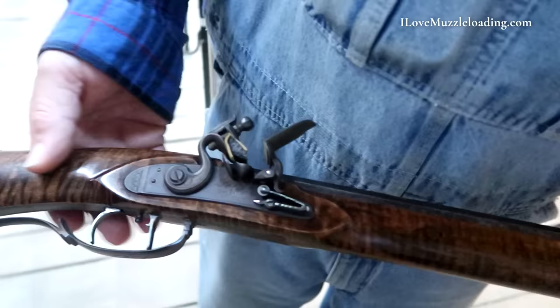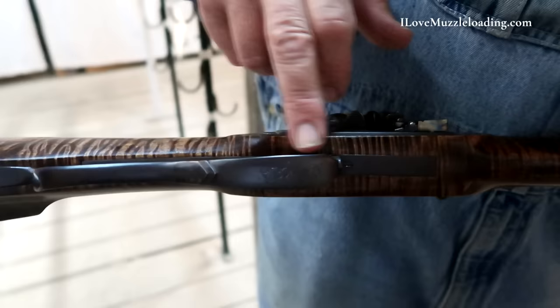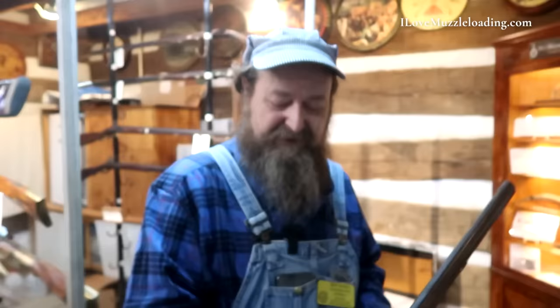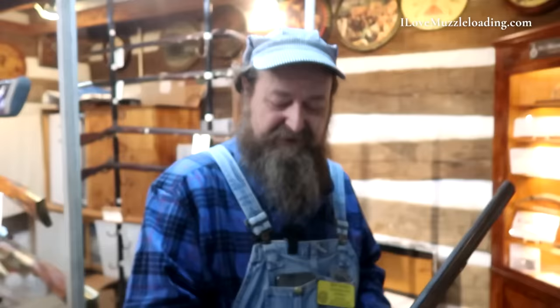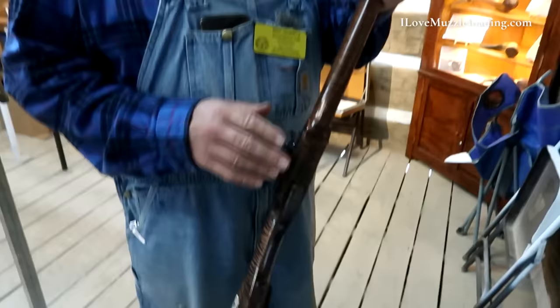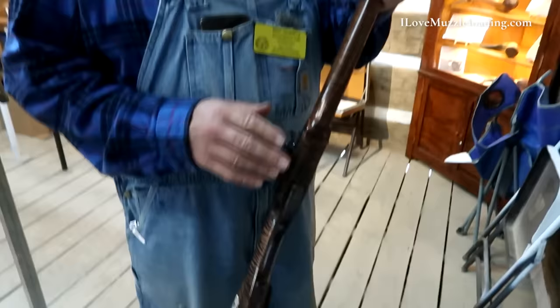Well, this represents one of his earlier works, actually in the late 18th century. The trigger guard is forged and forge-welded here, there, and there, just like the original. The triggers are just like the original, and I found a lock that matches the original quite well. The barrel is actually an original barrel that my client found — it's probably 250 years old. We had the barrel reamed out and then had rifling hand cut into it, just like it was 200, 250 years ago. The lock was made by Liston Rice at Buckridge Flintlocks. Everything else on the gun was made by hand by me — even the wood screws. There are 27 handmade screws in this gun and they all line up in line with the bore.